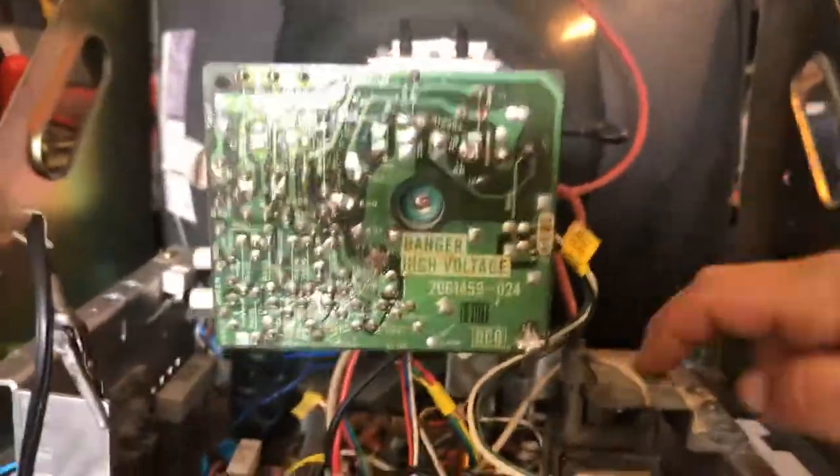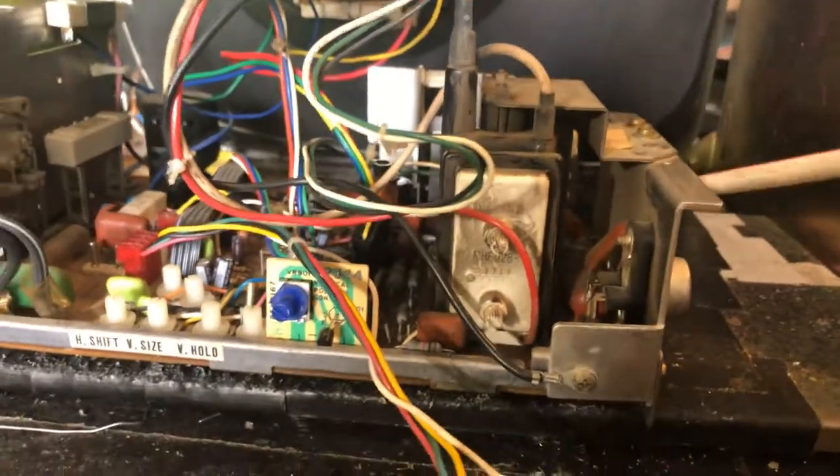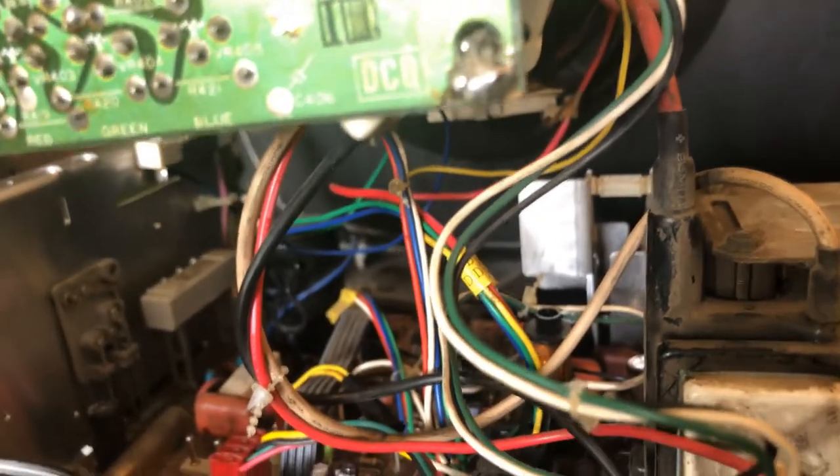All new caps. When I have intermittent vertical collapse, one thing I like to do is tap on it, and you've got to watch where you touch — that'll zap you. What I do is I'll grab a toothbrush, give it a good smack on the vertical heat sinks, side here, and see if anything twitches on the screen. And the screen is rock solid right now.